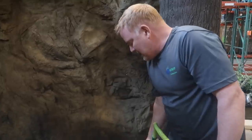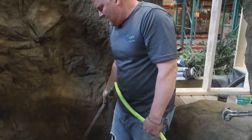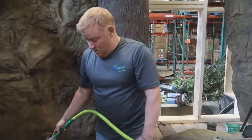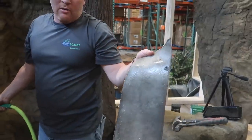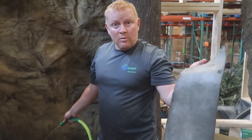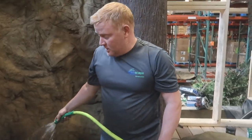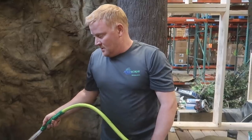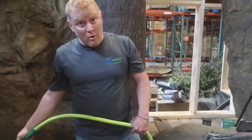We've got to rinse that stuff off and pump it out of here because we know it's not safe for all the animals. This stuff is going to turn into essentially really thin pieces of concrete — it's a woven material that has the Portland cement built into it. Here's a piece of it; it's now been totally saturated. We'll come back in six to eight hours and it'll be as hard as concrete. We use it a lot when building bigger commercial features — we'll put it as a pad down behind the liner and it keeps rodents from burrowing through. Here we're doing it as another safety precaution for the rubber liner, making sure there's never a hole in it, because a hole in this one would be nearly impossible to fix. Not cheap insurance — this stuff costs a pretty penny — but it's well worth it, and way less expensive than fixing this thing.